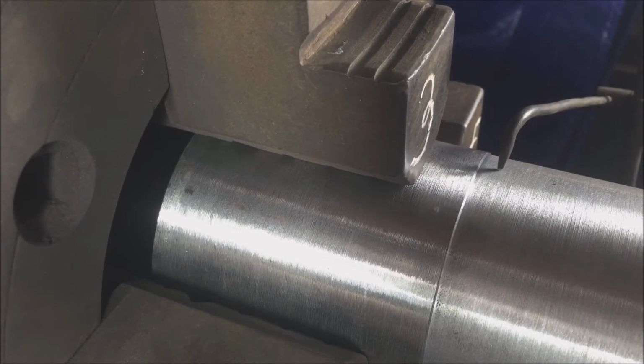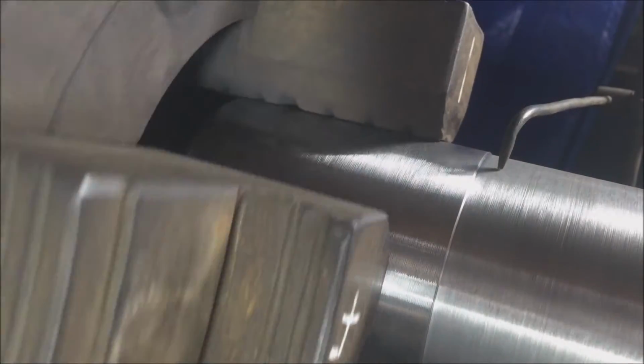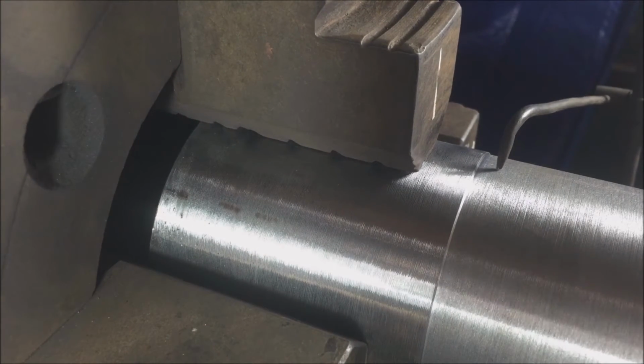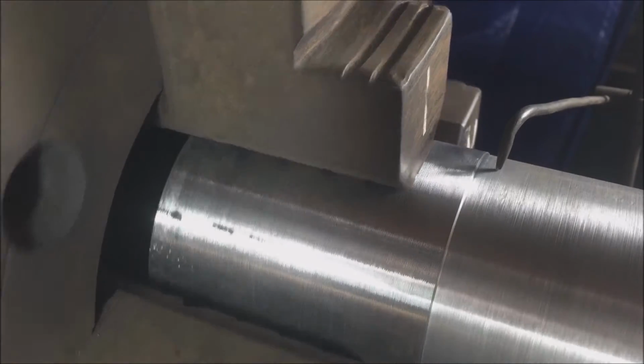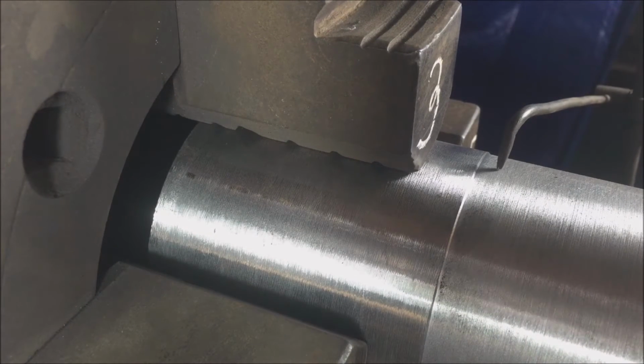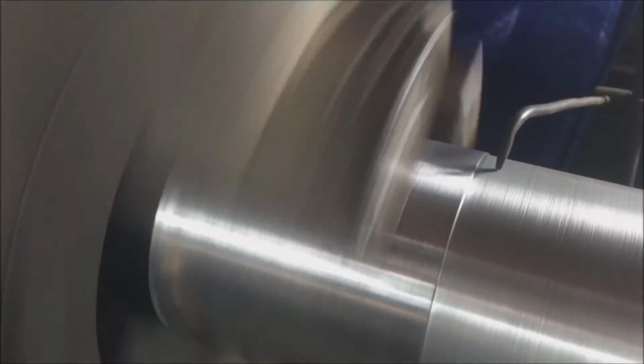After all the tightening and loosening, we are almost done with jaws number 2 and 4, where the gap is almost the same now. Shift focus to 1 and 3. 1 is the high point, we need to tighten it, and 3 is the low point, we need to loosen it. Again, keep adjusting till the gap is equal. Ultimately, the gap at all the jaws will get equal.